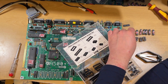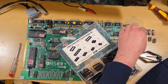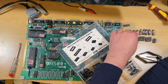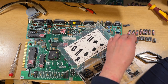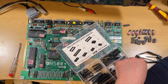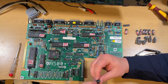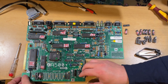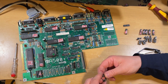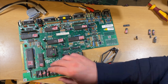I don't have a 20-pin socket, so I've improvised - I've used a 14-pin and a 6-pin together to make my 20-pin sockets for this memory, just to put it back on the board. Now I've found a faulty memory chip, I'm wondering if that's what was causing the issue, because a green screen normally indicates a memory problem. I'm going to take the good memory chip from the 500 to replace the bad one in the 500 Plus.